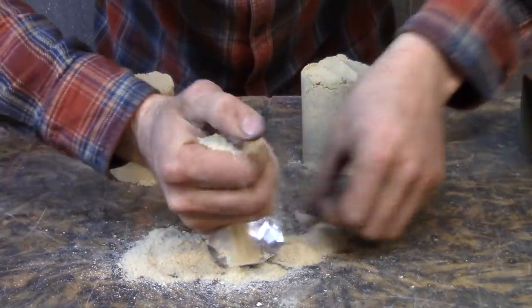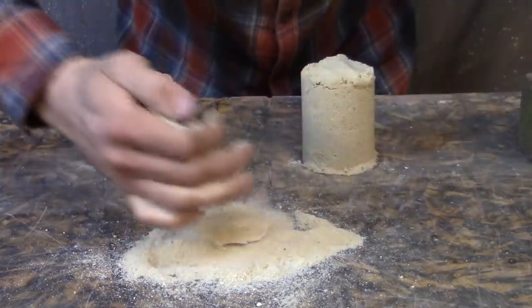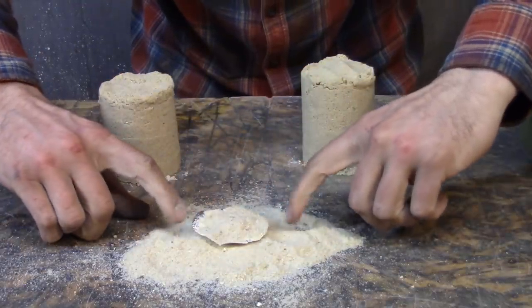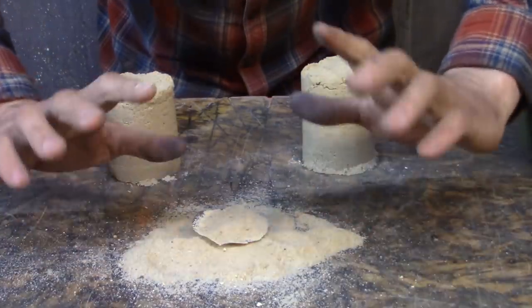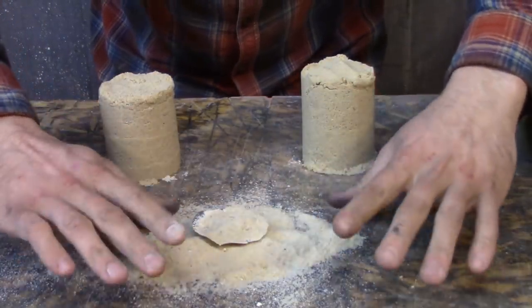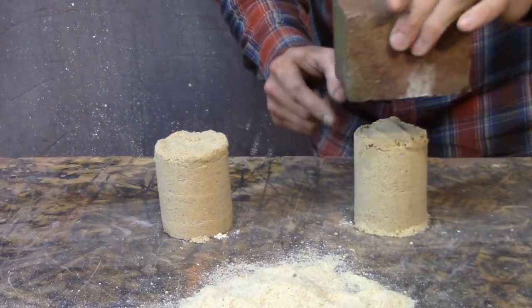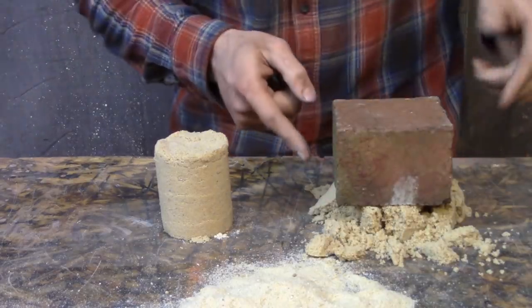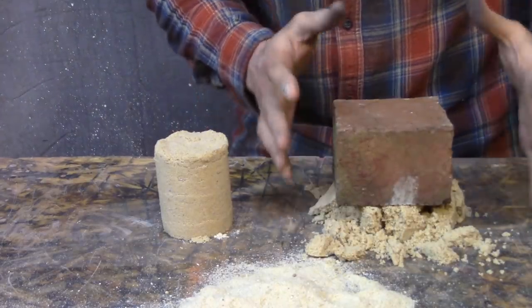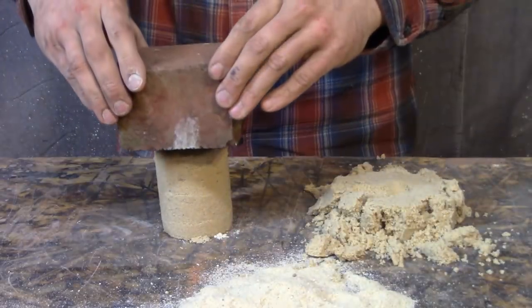But if you put layers in between, and then another one, and then another one, the angle of repose off of each layer is all that you'll get the effect from. In this way, the sand and the gravel that I put in will support itself, and I don't have to worry about squishing my pipes, just sand. It doesn't support itself, and all that sand pushing to the outside could potentially collapse the walls of my drain pipe.